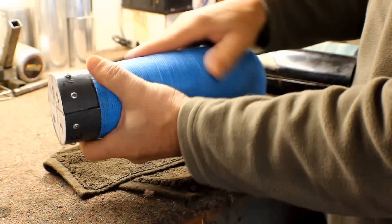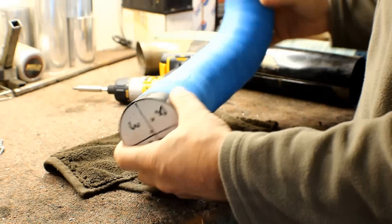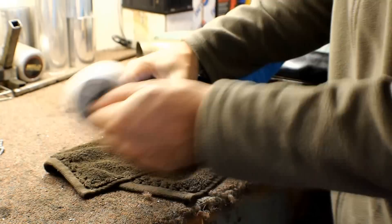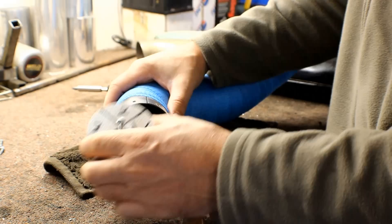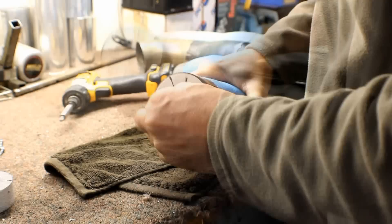It's been about 10 minutes. It's nice and hard, it's not tacky. I've already took the screws out of this side. I'm just going to take the screws out of here and this is basically just going to release this plug that I've got in the end. Once all the screws are out, I've got these plugs where they can just pull out — it's just a piece of plastic. I've got them numbered so I know which piece of steel goes with which part of the plug, just so the holes line up. And it also helps me put it back together pretty quick.